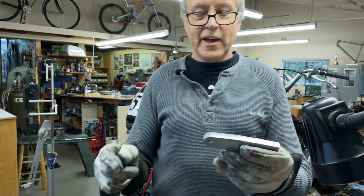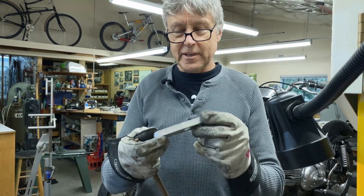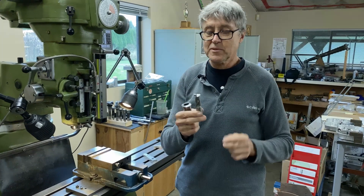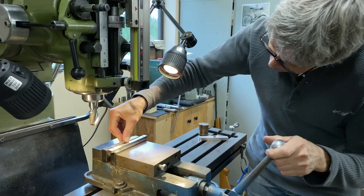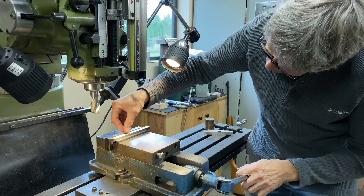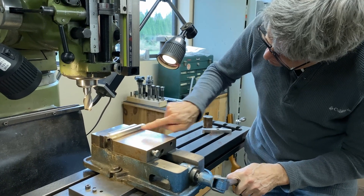Let's go mill some flats, save some weight, make a little scoop with a ball end mill and things like that. Over to the mill. I've got a really sharp end mill, M20, so I'm going to be milling in metric. I've got a little height block sitting on top here and I'm lining up my felt pen mark. It doesn't have to be super accurate.